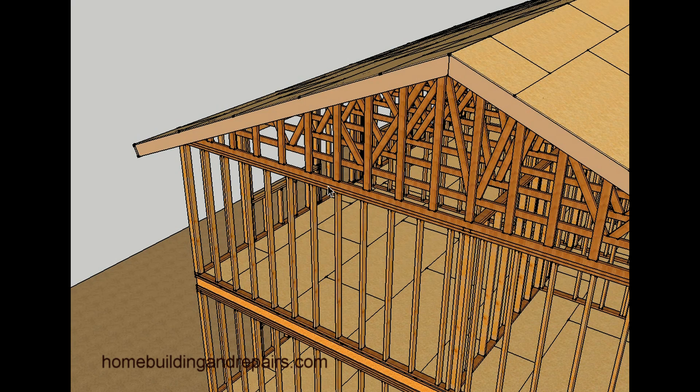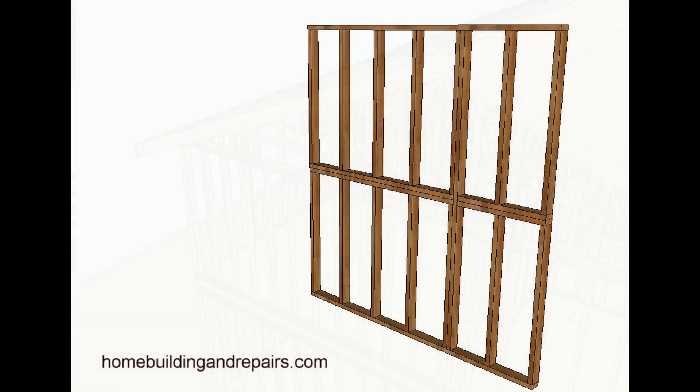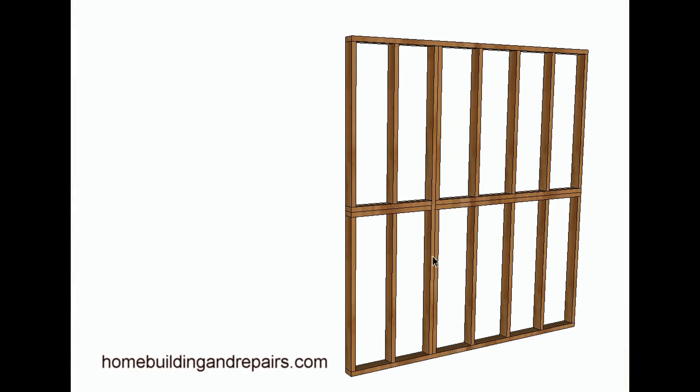But I have seen walls where they have a heavy load on them and they will start to buckle. Here's one way to fix something like this: install a full-length wall stud at certain intervals — let's say 32 inches on center, every other stud or every third stud. The engineer I worked with called out for full-length wall studs every four foot on center, and that seemed to really strengthen the wall up.